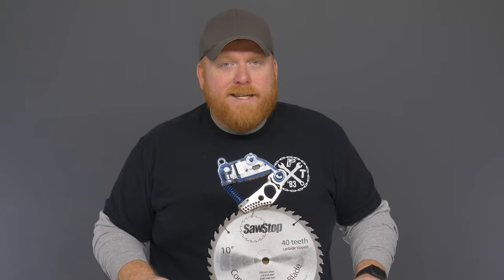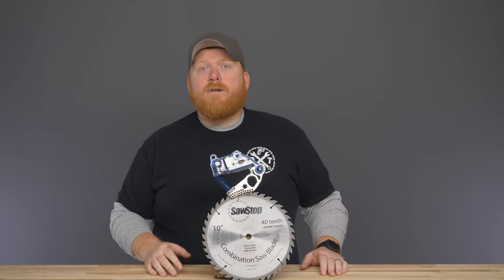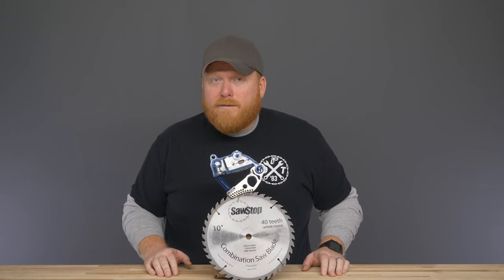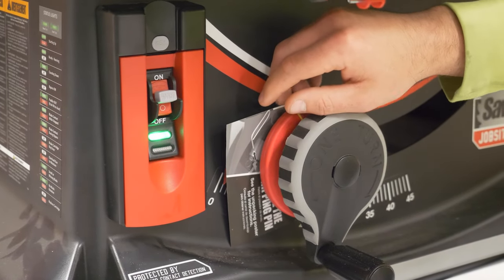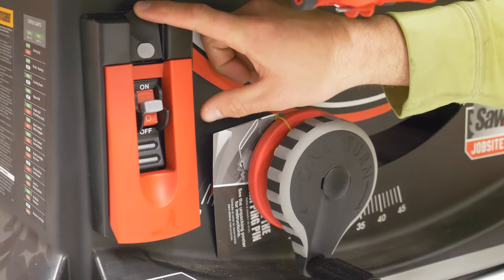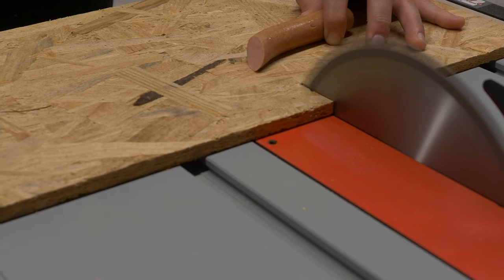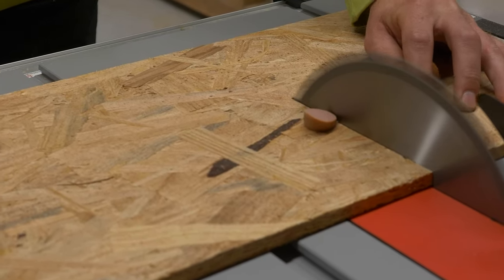They say you can evaluate the condition of your blade for future use, but I'd just replace it. If you're concerned about ripping a bunch of green wood, or you need to cut conductive material such as aluminum, you can shut off the SawStop safety feature and put it in bypass mode. There is a light that will indicate if the brake would have engaged or not. This will help you determine if the wood you're ripping is conductive, and also allow you to proceed cutting conductive material without needing to replace anything.